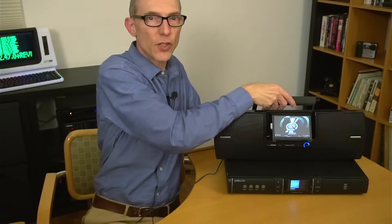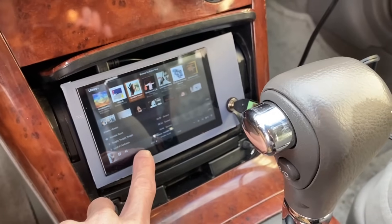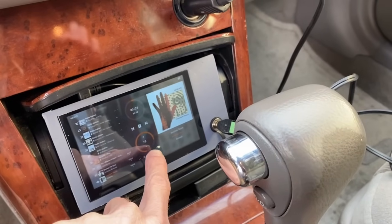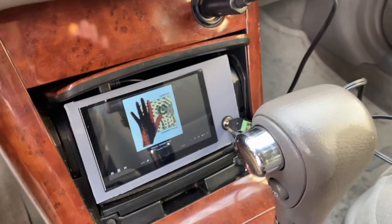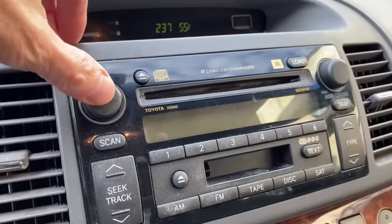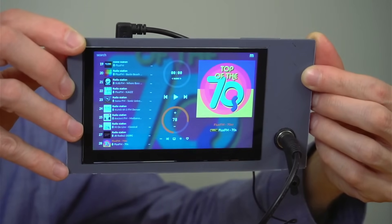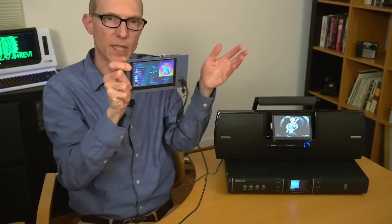Let me show you one more player. This one is designed to fit into the empty space in my car's dashboard for an open-source, non-trackable music experience on the go. You only need to plug in power from the cigarette lighter, and the built-in FM stereo transmitter sends the Pi 3's audio to the car's radio. It has a touchscreen for control and a 3D-printed case that can be adjusted to fit various sized dashboard spaces. This one's about $75 in parts and includes 256 gigabytes of internal storage.